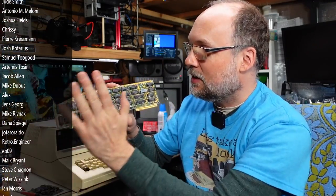And lastly, we have this. This is the CP/M card that was in this machine. This is also bundled with this computer to give it more features to make it more appealing than an Apple II computer. This is a PCPI CP/M clone, it looks like to me. 64K of RAM, 6 MHz Z80. It should run pretty quickly. So in the next video, we will check those out.